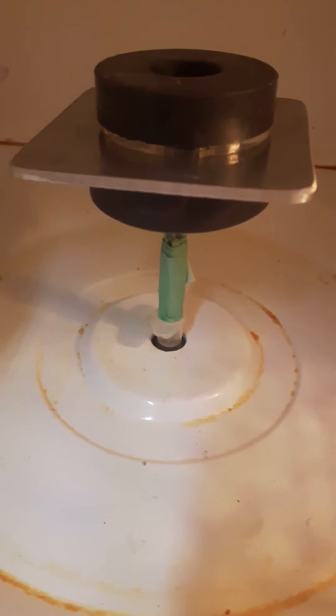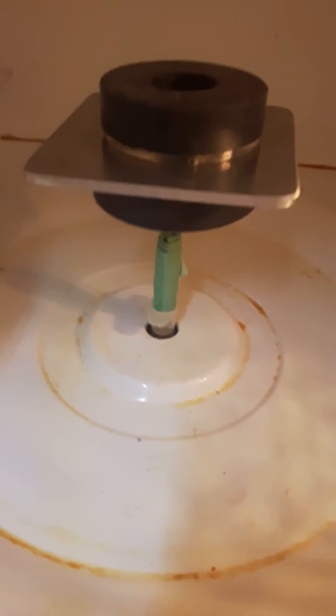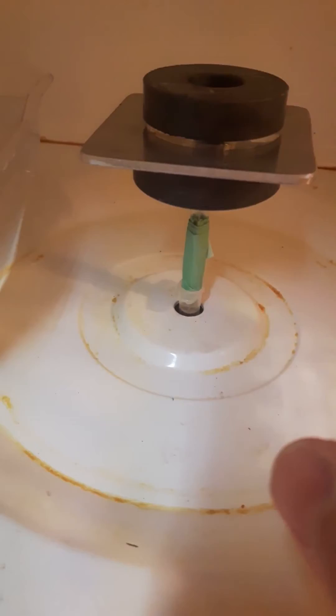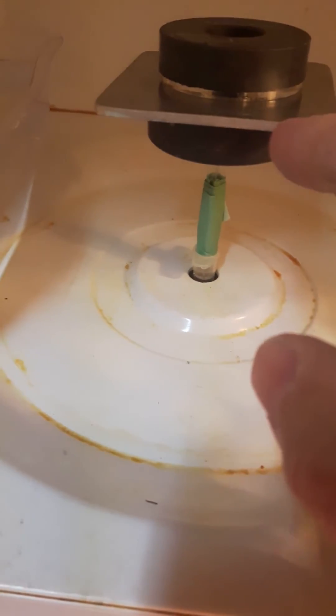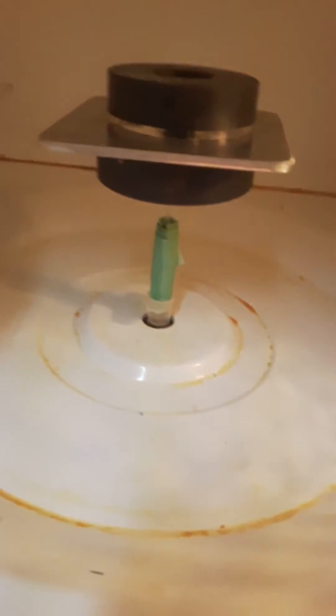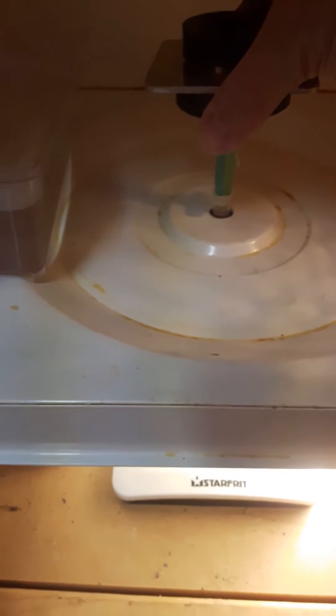That's where roughly the magnetron frequency — I think they're about 2450 MHz — so in order to get dynamic nuclear orientation, there should be somewhere in the neighborhood of 800 Gauss in this field. And then this is just to absorb extra energy — this water here. And this is just a plastic syringe which sits on top of this scale. That's basically it — quick and dirty, cost me nothing to do this.